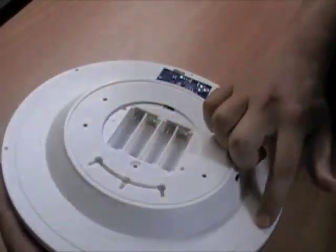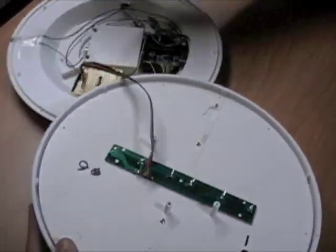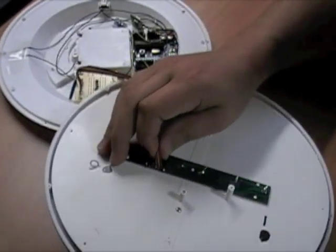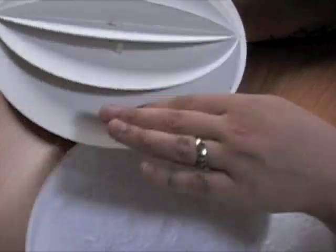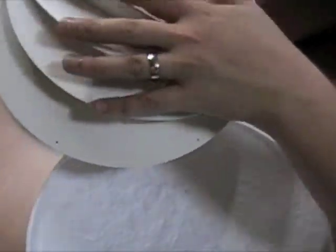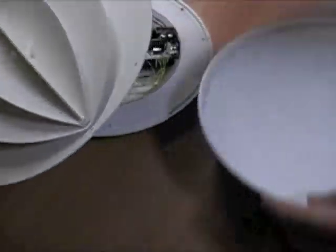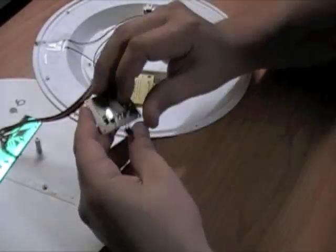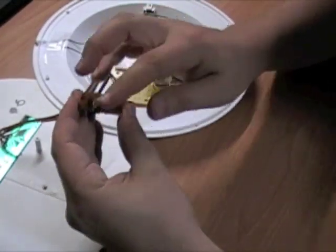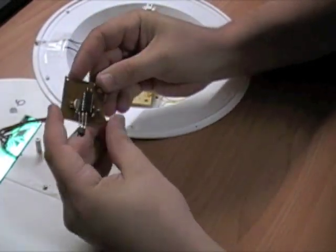As you can see there's basically just some screws around the outside here. There's nothing holding it together — I've already removed the screws. Take the screws out, go like this, and there's more screws on the inside panel here. You can see these little carved wedges allow the LEDs to only shine through in a certain area. On the inside we originally had this little controller board here and it had the infrared receiver that would pick up the remote and send out the signal.